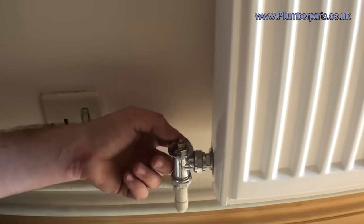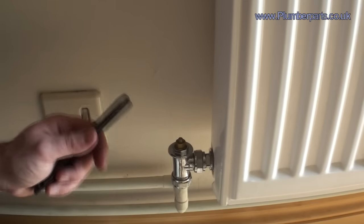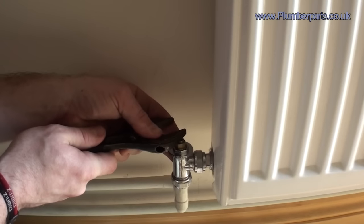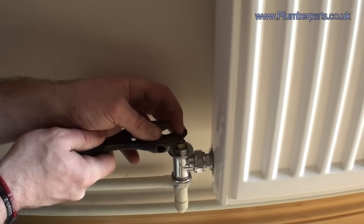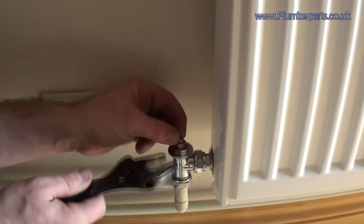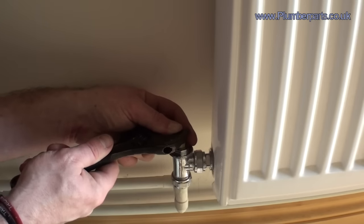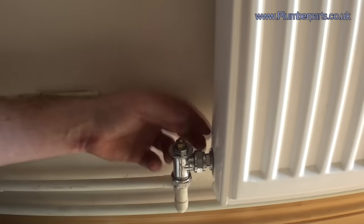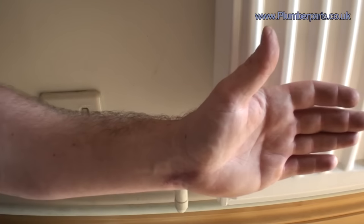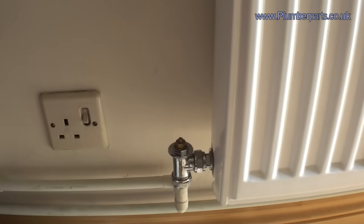This particular type here, fortunately, because we don't have the traditional pin problem, the best way to deal with these if it's stuck down is to get a large-ish bit like that, and then just slightly tap it just to shock it — that's all you need to do. You're not trying to bash the hell out of it so it moves; all you need to do is shock the tension out of what's holding it in place. Then it should pop up, and if you've bled the radiator of air, undone the TRV and the lock shield, and you've got a great flow, you should then have a hot radiator.